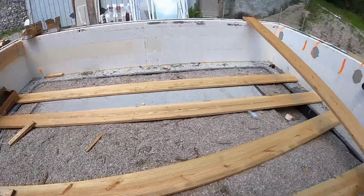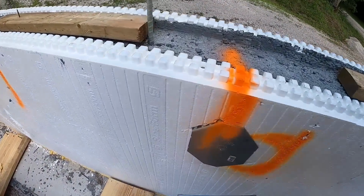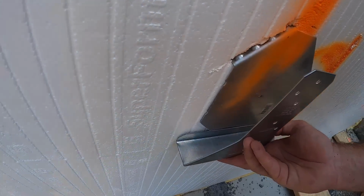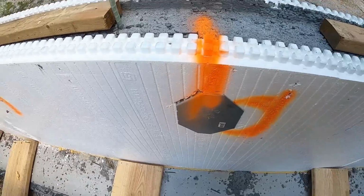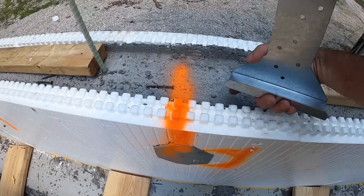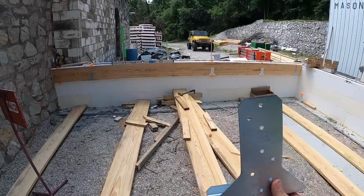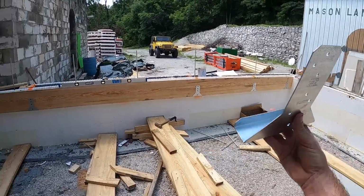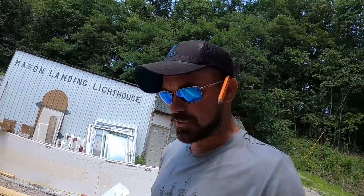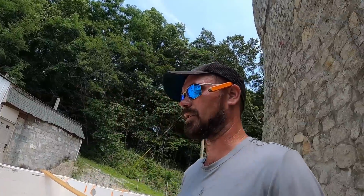and then the brackets come into play. So again, we have these octagon plates behind the 2x12s, and essentially what we're doing is trapping that 2x12 between two metal plates like you see here. And also remember, this metal plate is poured into this concrete. So by the time we attach these brackets to the octagon plates through the 2x12, every 4 feet, this attachment is considered load bearing. This attachment is probably stronger than most any other attachment that you can use.